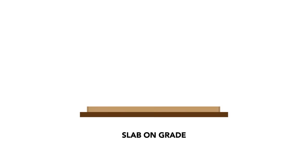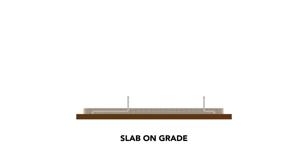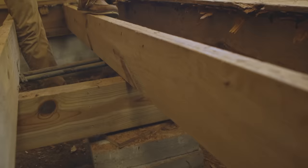There are two common ways to build a house. The first is called slab on grade — a mold is built out of wood, all of the sewer and water lines are laid out within the mold, reinforcement wire is added, and then the mold is filled with concrete. The second method is to build a house with a crawl space or basement.